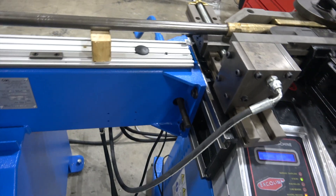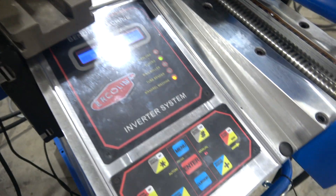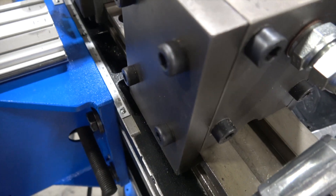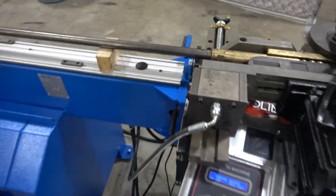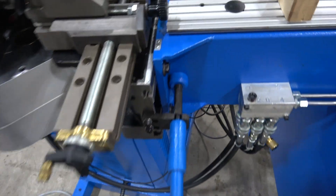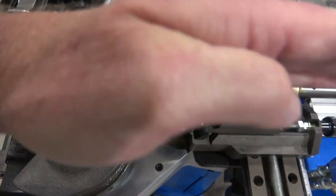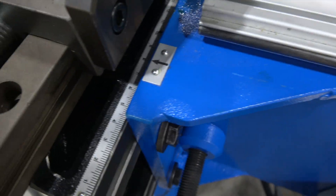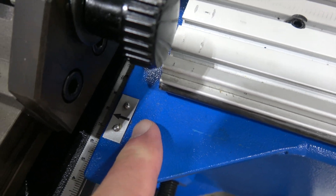Before shipment, the mandrel mount would be on the machine head. You have four bolts to put on, and there are a couple of dowel pins on the backside that help line it up. You might wonder what that crank handle is on the back — it allows you to set your table to the radius on your tool. We want a nice consistent line all the way down. Moving this table back and forth, you can see it's graduated. We'll set this to match the radius of the former on the tool we're going to bend.